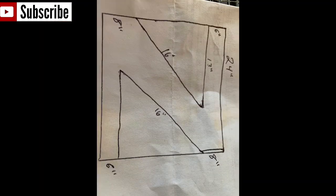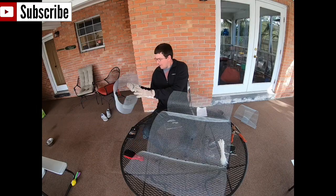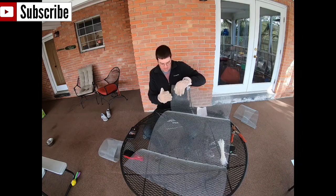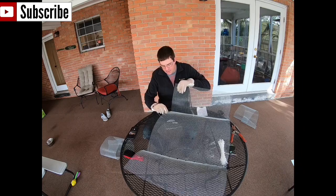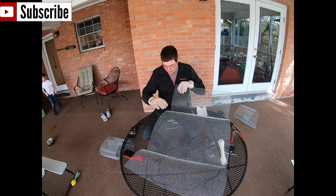Let me look at my diagram. This is the Z-trap right here and I've got to build the side with a triangle. There's a six inch section on the left side at the top, then a 13 inch straight run. At the very point of the triangle there'll be a one inch space, then it comes back 16 inches, then another eight inches on the bottom, and it's opposite on either side. We're going to take this one foot piece, tie it into the corner, tie it all the way up this one side, eight inches out here, and then make our 13 inch run this way.